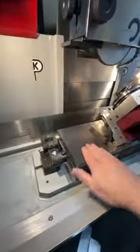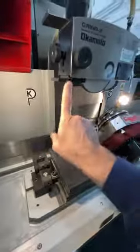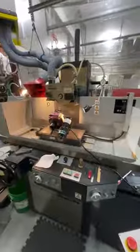By the way, that was a total downfeed on the head of 30 thousandths. So it cleaned everything up. It looks good. There were no major surprises. Let me show you what I'm doing here. I'm just looking for any schmutz. I think almost 100% must have gotten sucked up by the mist collector, which makes me happy. So there's very little cleanup. And that concludes our correction of the D-bit for today.